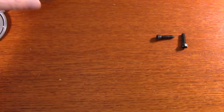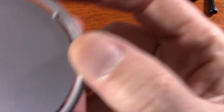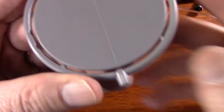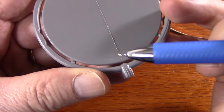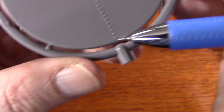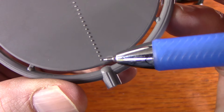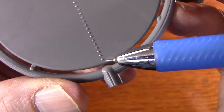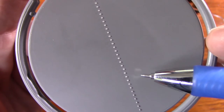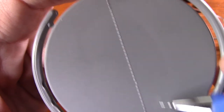The other question I was asked — let me zoom in for this — is how detailed can the parts be? If you look here, there are some details. These are rivets, about 30 thousandths of an inch in diameter, and they are a dome shape. So you can see that you're able to get really high quality parts. You can see that one of the rivets is actually slightly off, which means that's the way it is in the mold.